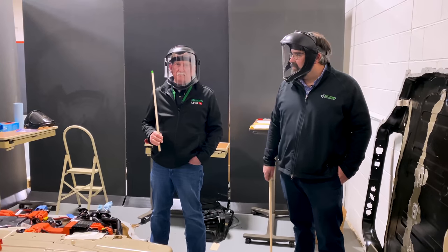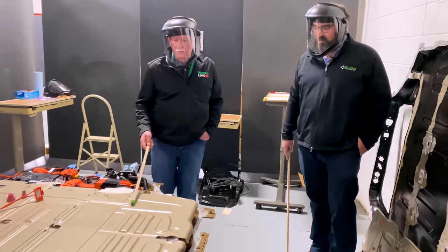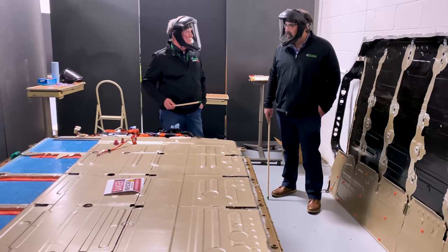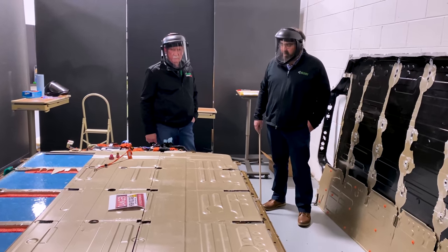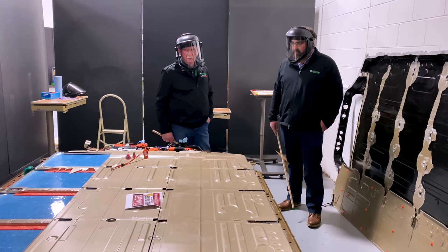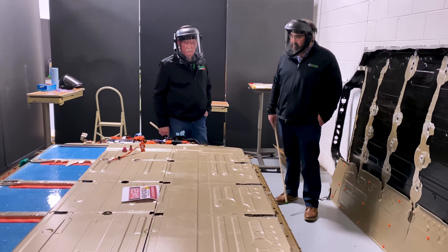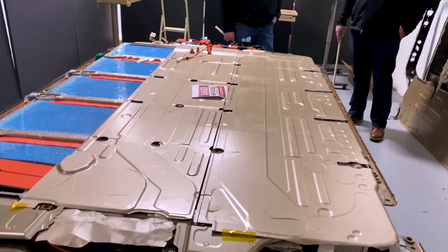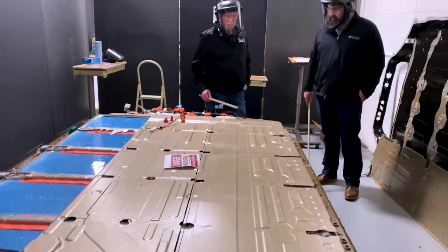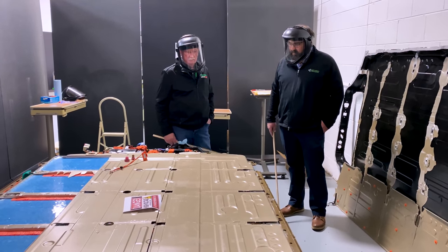We don't want to put on the gauntlets. The first thing we're going to talk about is this stuff right here — this is the mica shield that Tesla's put in place. This is the first time we've seen it. The Y and the 3 did not have it on top. This is 15 kilos, or about 33–34 pounds, and that adds quite a bit of weight, but Tesla must have some reason for doing it. This bolts directly up into a steel frame.